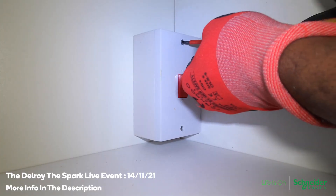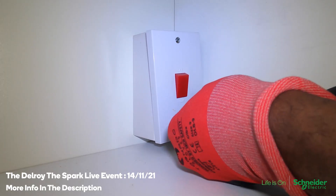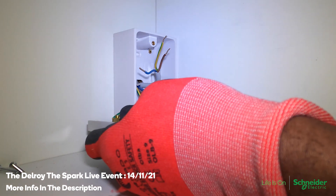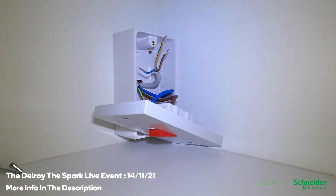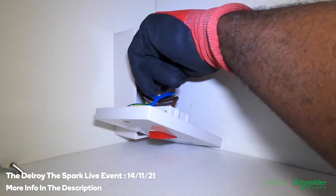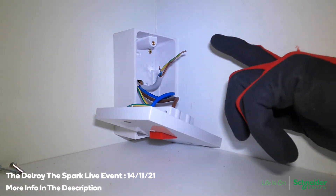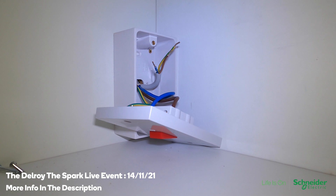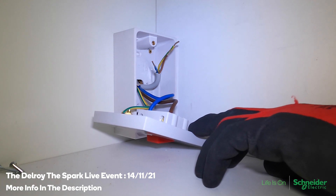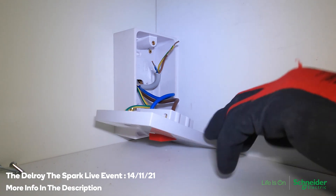I can see it could be plugged in there. I wonder if I pull it out whether it's going to give me aggravation getting it back in. What I'll do — I'm going to pull it out, put it on a plug top and try it in another circuit. I'll put a test on this circuit, but I've got a feeling there's nothing wrong. Can't be too sure though — I'll do a general test on it and see what comes up.